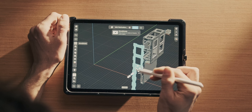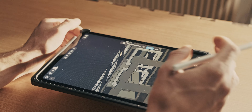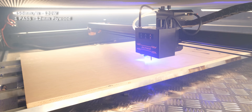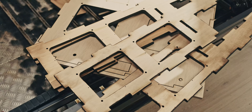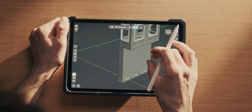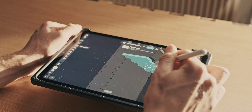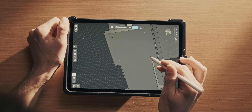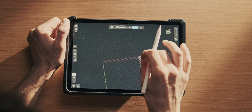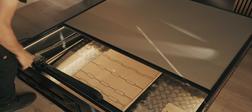Moving on to the side plate — it's about 120 centimeters long. One of the 3D printed inserts I hope to put a 3D scanner in there, and the top one might hold a drill or a patch panel for power. It takes quite a bit of trial and error to find optimal cutting settings; I landed on 450 millimeters per minute at 100% power, single pass, without too much charring. Next are the connecting pieces: the bottom plate holds everything together, and the other bottom plate has holes for the casters pre-cut so we don't need to measure anything — just pop the caster on and screw it in.